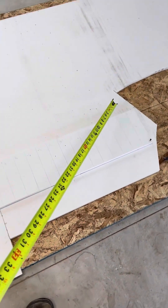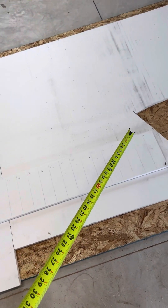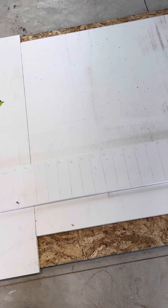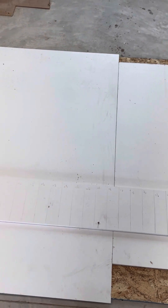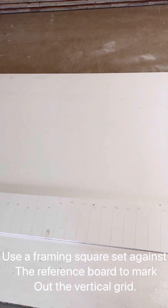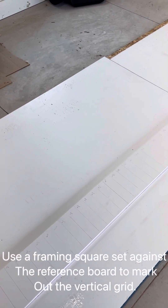I left enough overlap for my seam, and I made sure I kept this up high enough so that when I get the full thickness of my board I'm not running out of the bottom. A little bit of thinking ahead. Now the painstaking process of laying out these points — I'll probably do every other one and see if I can find a common radius, and that'll save me the trouble of having to do every single one. But if I need to, I can lay out every single one and get the total curve.